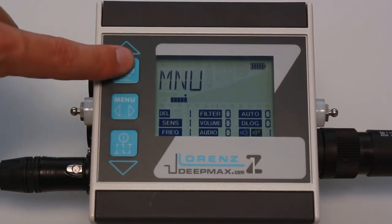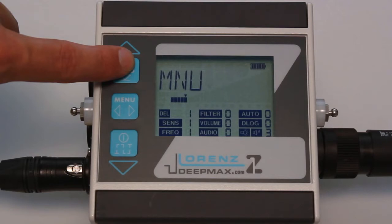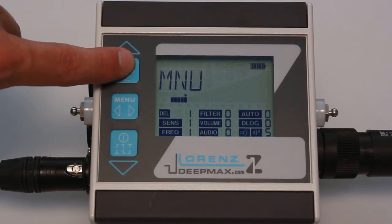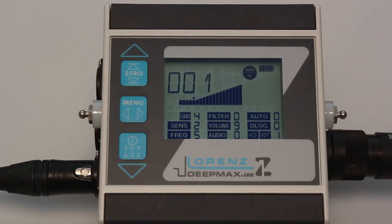Tone provides a range of different audio signals depending on the metal objects. Position one gives a ticking sound with increasing frequency for all metals. Position two has frequency and threshold increase simultaneously. Position three gives a high tone for nuggets and a low tone for all bigger ferrous or non-ferrous metal objects in ground modes one, two or three. Position four gives a low tone for ferrous metal objects and a high tone for non-ferrous metal objects or hand-sized or larger ferrous metal objects. Position five is for a double D coil, with three distinct tones: a low beep tone for ferrous, a high beep tone for non-ferrous or large ferrous metal objects, and a medium beep tone for weak indications or small low conductivity objects. Very fast settling eddy currents, for example with small coins or thin plates, display very low indications together with a non-ferrous indication.